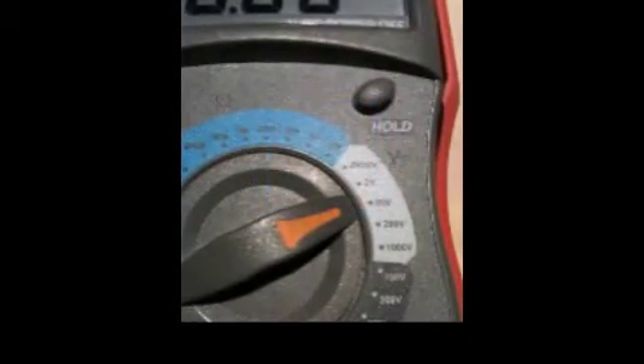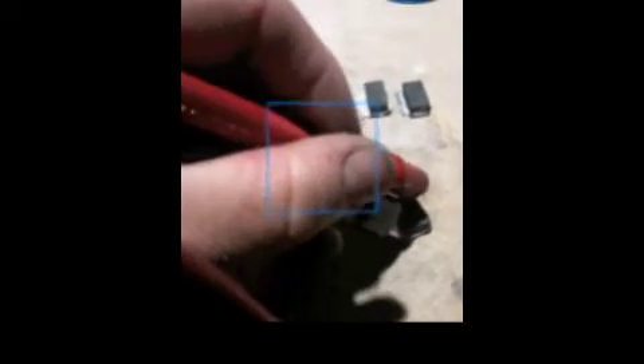Here we have these little electrodes — I'm just going to pick one of these guys out of the bunch and show you what this is making. Please forgive the videotaping; I'm trying to do this with one hand. I'll get this set up — we're on the 20 volt setting — and I'll show you where we're at from a voltage standpoint. You can see 2.75 volts on this itty bitty little electrode.